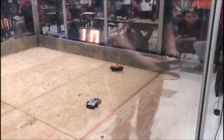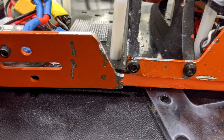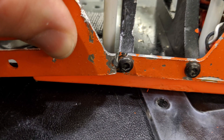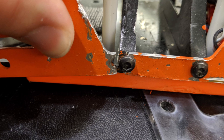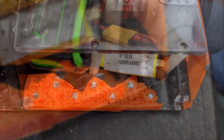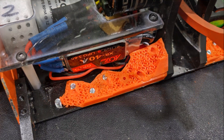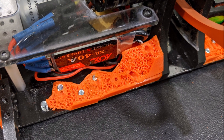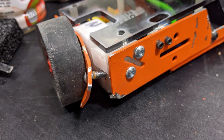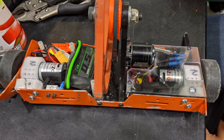Hopefully I'll have it ready by S.W.O.R.D. in November. While this damage montage plays, let me talk about future plans. I definitely need to beef up the armor a bit — looking to put titanium in the front and might thicken the rear armor around that screw hole since it broke there. All the 3D printed parts, I'm going to be using nylon, if not carbon fiber filled nylon, because PETG has proven to be way too brittle. I recently bit the bullet and bought a Prusa Mark 3S, and I've been able to get some successful nylon prints, looking forward to experimenting with higher end filaments.